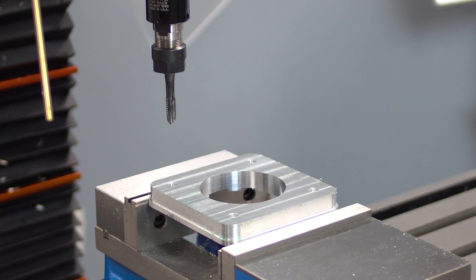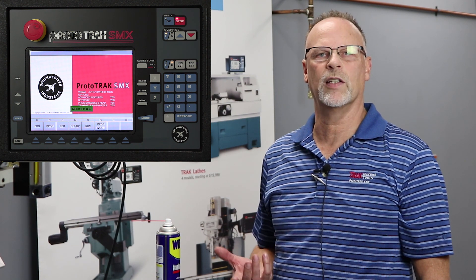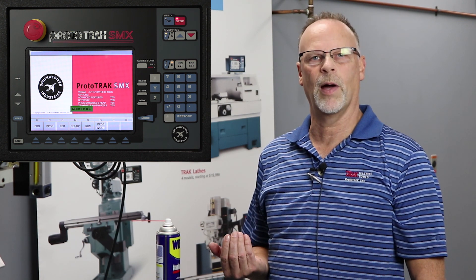If you look at the tool that's in the spindle right now, you'll notice I have my tapping tool in there and it has a floating tapping head, which is required in order to cut threads with a tap. There's no encoder on the spindle, so without that it doesn't know exactly when it reverses direction from down to up. The float allows it to compress as it starts to thread, and if it doesn't have a perfect reversal it allows it to expand as it comes back up out of the hole.